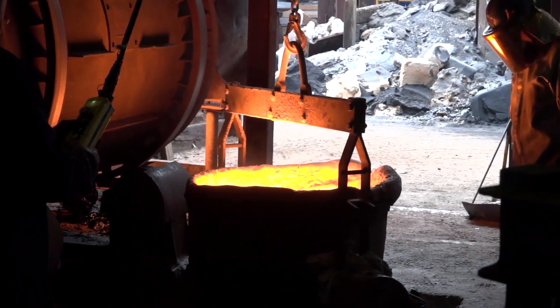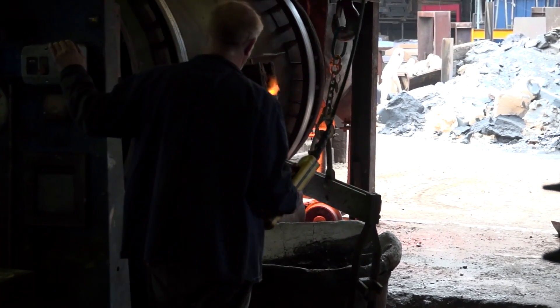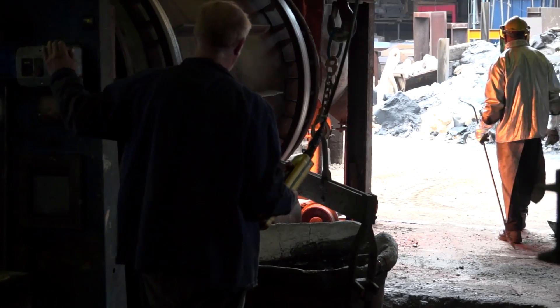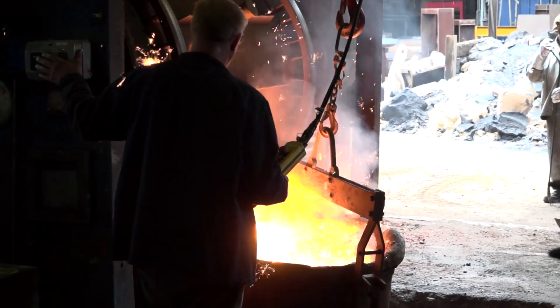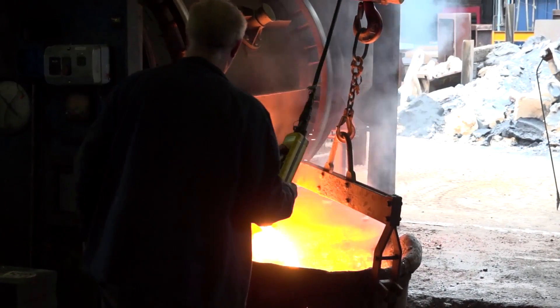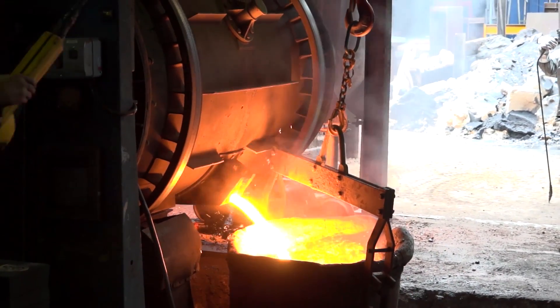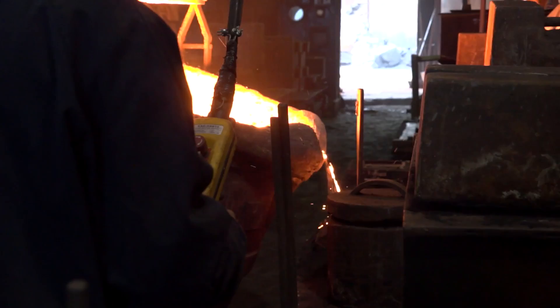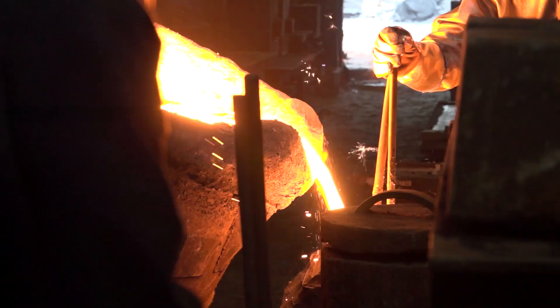In the background it's getting a bit hot — what's going on? We're pouring our iron into the molds. This is SG iron, modified by pouring the liquid iron over magnesium, making the iron ductile. We're taking that molten iron down the shop in ladles and tipping it into the mold. That ladle's holding about two tons of iron. What temperature? They're pouring at around 1,350–1,370°C.